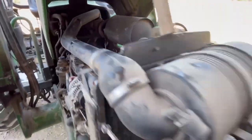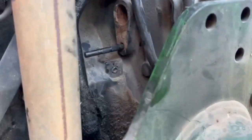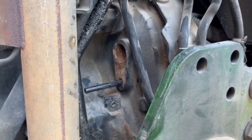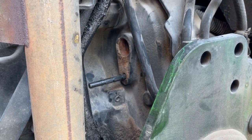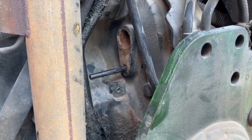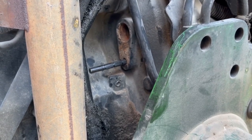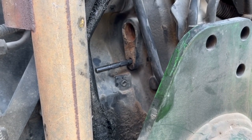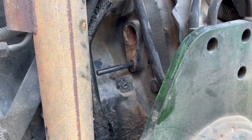On the other side there is a cap that sits on that hole right there. The top hole allows for some type of faux starter motor to go in there, get the flywheel teeth, and turn the motor until it's aligned. I just used the starter to do that. You can see I have a punch in the bottom hole — there's a hole in the flywheel that lines up to top dead center. To find that hole, you just rotate the engine until you can get a punch to engage the hole. So I'm going to make some adjustments on the valves that are fully closed right now, then come back, rotate it 360 degrees, make the other adjustments, and give it a try.